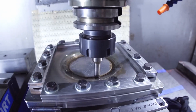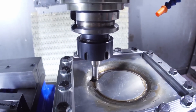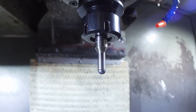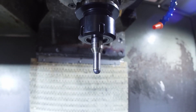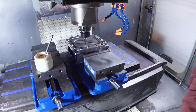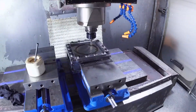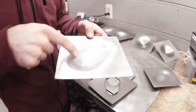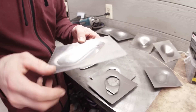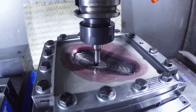Over on his channel, Russell makes a video on his experiments with single point incremental forming. This uses a CNC mill with a smooth hemispherical tool acting like a forming ram for a thin sheet of metal. He experiments with a few different 3D shapes and some different materials, like stainless steel, aluminum, and titanium. It's a cool experiment, but the real gem is where he reviews the parts to determine where the process succeeded and why it failed when it did.